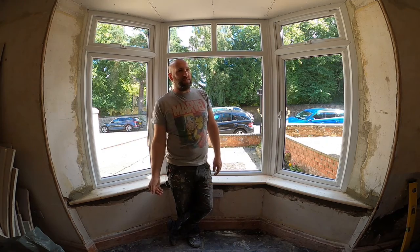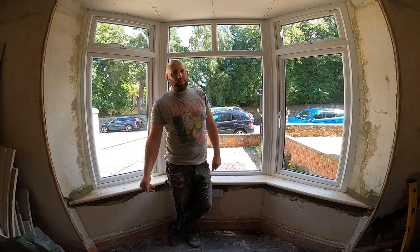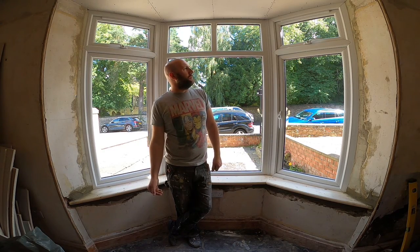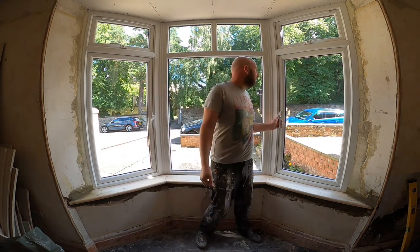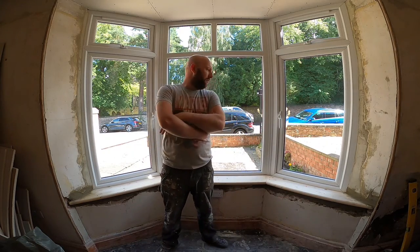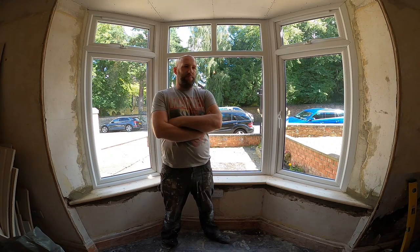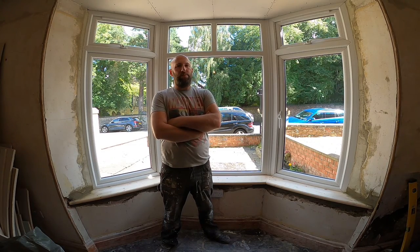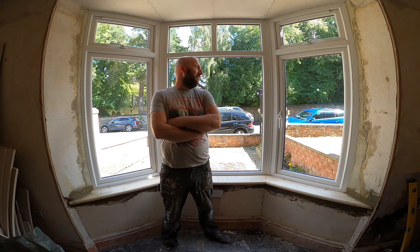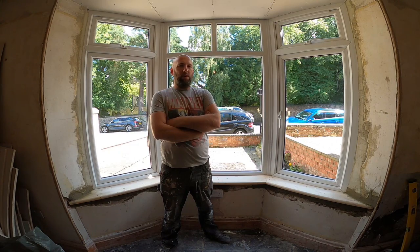So the final stage for this, and all the windows, I'm not FENSA registered, it's just a DIY job. So I submitted a building notice to the council before I started this, and they'll come round and sign them off. And then if we come to sell the house down the line, we know that they all comply with building regs. I think the main thing to do with them complying with building regs was the vents. So the vents are in toughened glass, and they all have fire escape hinges on them, on all the windows that we've put in. When I ordered them, I said to the window company that they need to comply with building regs, so they designed them for me so that they would comply. So I'm hoping when the building inspector comes, there's no major issue. If there is, I'll stick it down in the description for this video, or I'll add a little bit on the end so you know. But as it stands, hopefully that's it, and we'll get it all signed off.